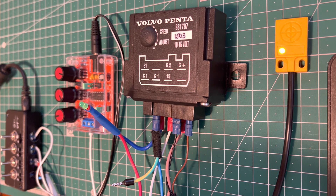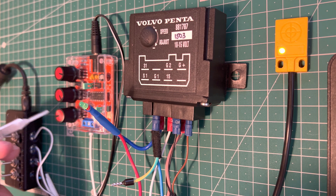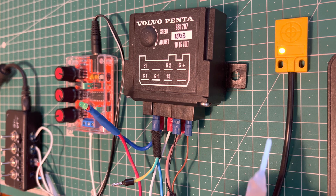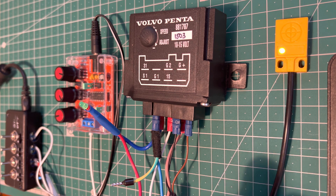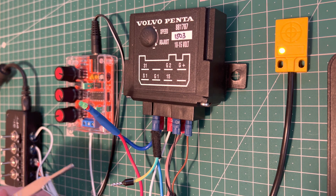I'm testing the Volvo Penta supercharger controller here on the bench with a rig that I've made up. We've got a signal generator which replicates the engine RPM from the pickup. We've got a proximity sensor here which matches the Volvo one electrically, but mechanically it's a different shape — this was only about £2 from an eBay-type seller. We've got the controller sitting here, all plugged up and ready to go.